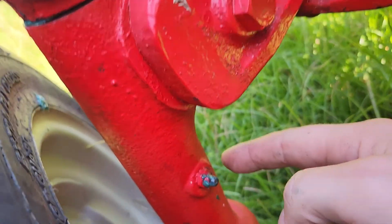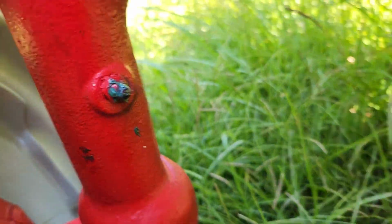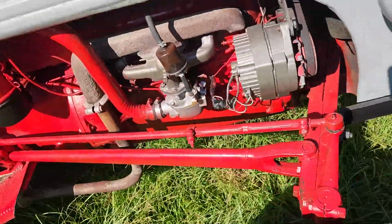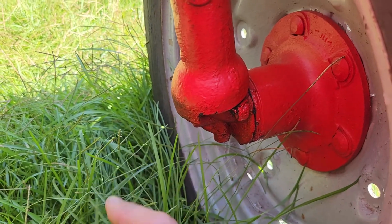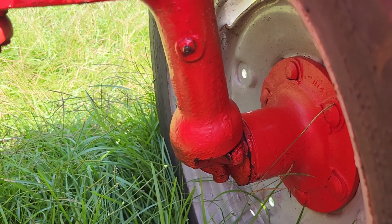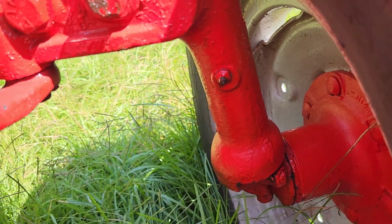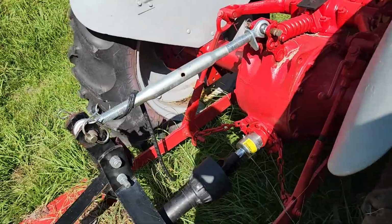And this particular one, this grease fitting, you'll see grease coming out up here, or down here, or both locations. This one up here, as you can see, comes out down here. This one here yesterday, right before I started getting any amount of grease to come out, I actually had water start coming out down here. And that's one of the reasons why you do want to make sure your equipment is greased, is grease will displace that water, not just lubricate the parts, but it actually helps prevent the water that will corrode getting into the parts. So you grease your equipment and it will last. If you want to say screw it and not grease it, then don't come back complaining that your stuff rusted away.